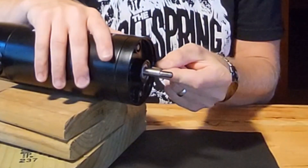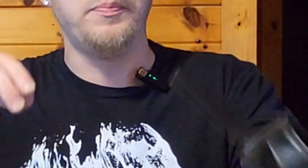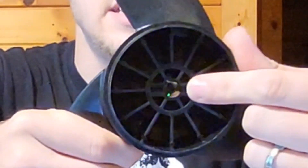So we're just going to reinstall it. If there were any weeds on that, you'd obviously want to clean them off. If your shear pin is bent or broke, you'd want to get a new shear pin. So you're just going to slide the shear pin in there. You want to make sure that it's mostly horizontal so that the shear pin doesn't slide out. You'll see on the prop there's a space for your shear pin to sit — you want to make sure your shear pin sits in there or you're going to have a bad time.